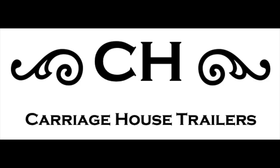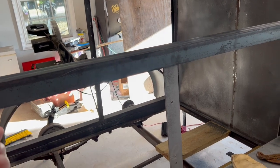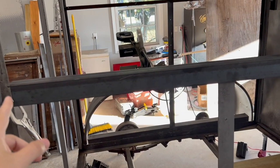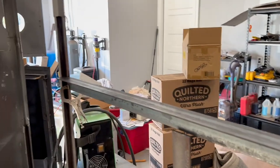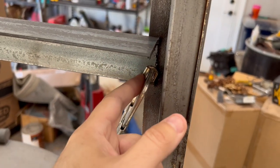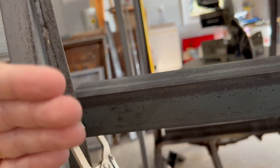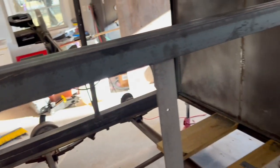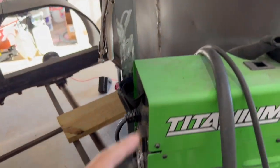What I've done here is use some two inch by two inch angle iron, eighth inch thick. I've cut this to overlap just a little bit on both sides. That's going to allow me to notch it out right here so that it will fit flush against that, and the same way over here — I'm going to notch this out so it'll fit flush against that.